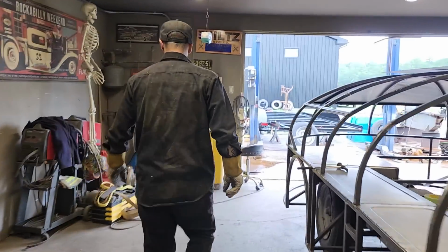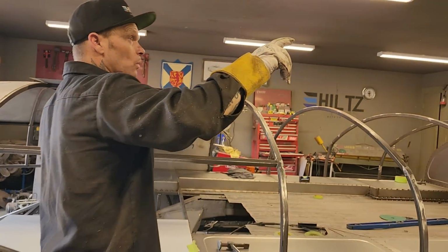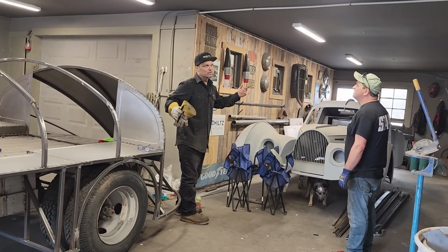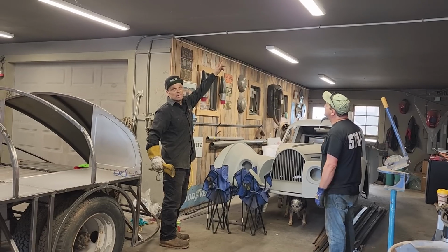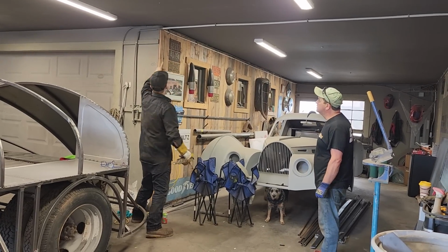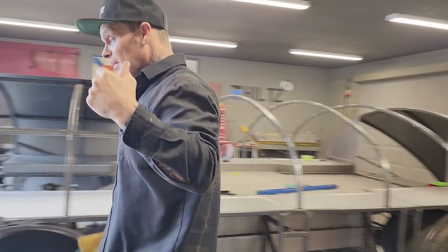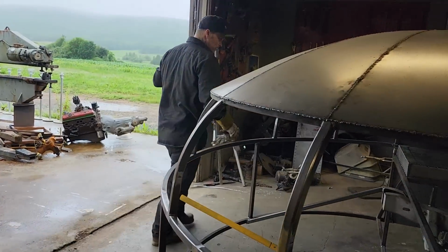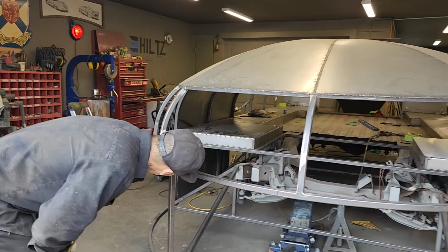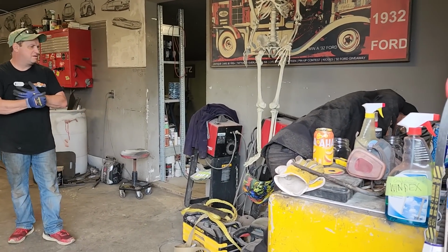If anybody wants to know, when I put the air compressor in here, it's been quite a long time ago. What I used to pipe it is water line, 150 pound, I think it says right on it, and I use them little metal clips that you do water line with. A little time, and that plumbed it up. Some people say it's probably not the right thing to do, but it's been 5-6 years like that or more. I haven't had any issues. If you want to plumb up your air compressor, that's what I did.